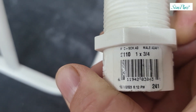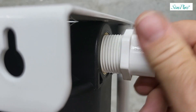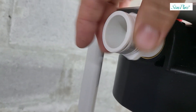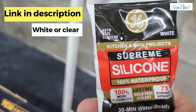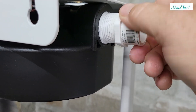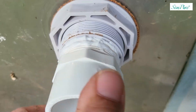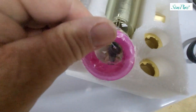The filters have standard one-inch threads, which works well because we have three-quarter inch PVC coming in. You do need to wrap them with Teflon tape, and I also use silicone on all my plumbing projects when it comes to threading. I even use it on the pool, which is under immense pressure, and I never have any leaks — so I highly recommend the silicone.